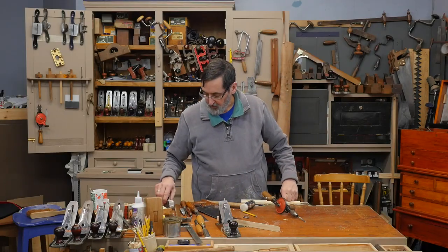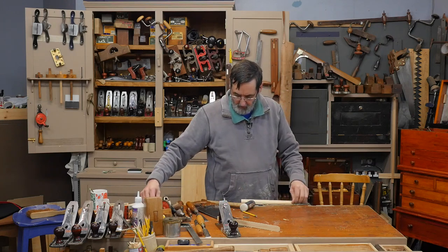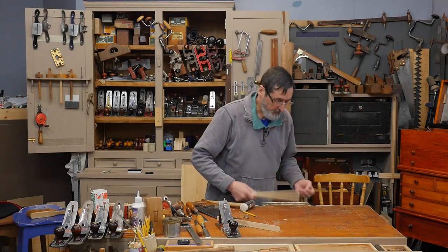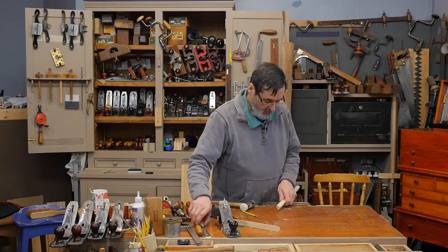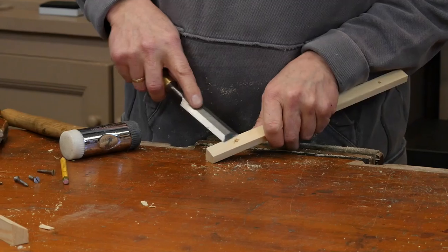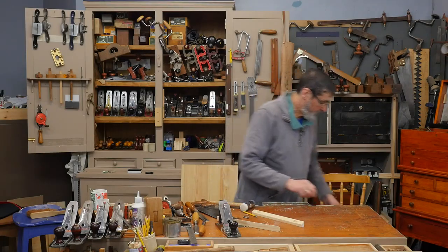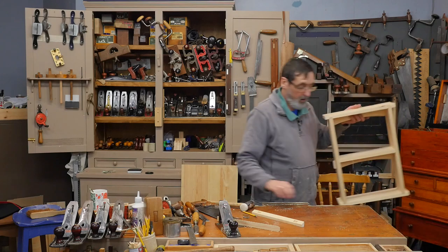And you want to countersink that. Well, you won't need to countersink this part, but you will need a countersink in a minute. Chisel, just chisel off these exit fibers here from when we drilled the hole. Now you've got to get this right, this next bit.